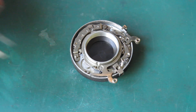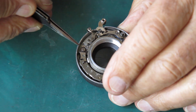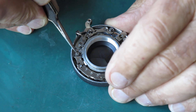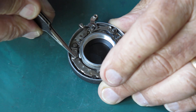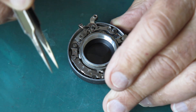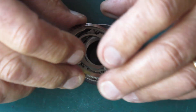The weekend has come and gone. I've been in here and I've adjusted the speed of the retard gear train by slackening this screw off slightly and moving this end of the speed train in for greater engagement of the arm here with the main lever, and that did the trick. I didn't have to move it far, but now the speeds are good, so that was the end of that problem.